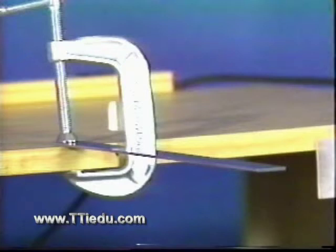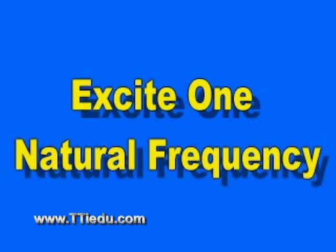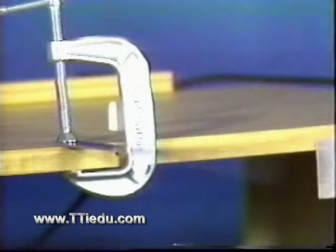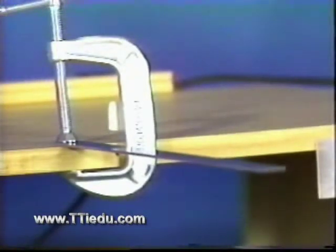If the beam has mass and springiness, it must have at least one natural frequency. Now I've clamped the beam to the table, and I'll pluck it to create free vibration of the cantilever beam's first natural bending frequency. Notice that damping or friction within the beam gradually reduces the magnitude of response.